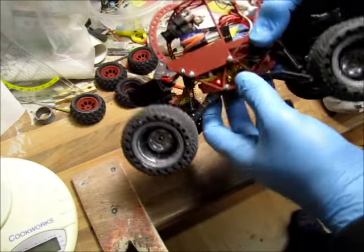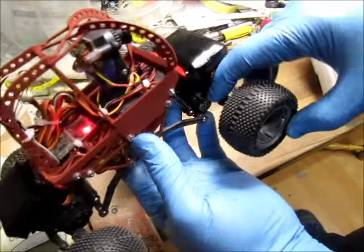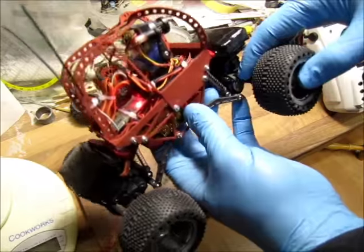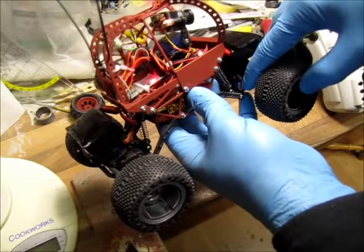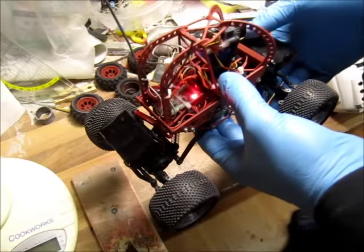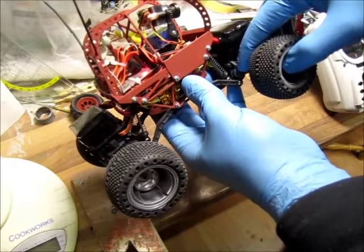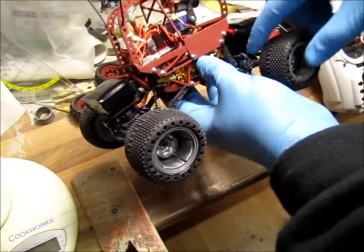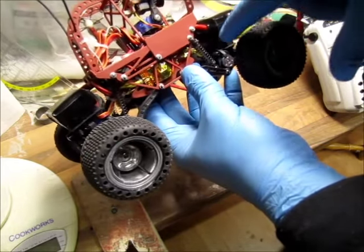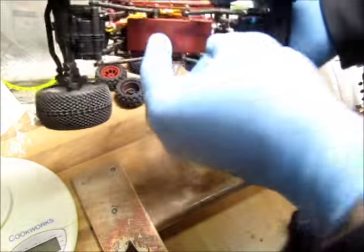For the powertrain, I didn't want to keep the brushed motors so I converted to brushless motors, as you can see. If you have any questions, check the link below — there's a build thread on FPV Labs with all the mods. I probably wouldn't do the brushless mod again — there's a lot of messing around. I tried the wrong pinions; they were 0.4 pitch. You need an 18-tooth pinion at 0.5 pitch — nothing else will fit, because the stock motors slide straight into the gear.